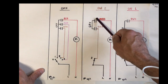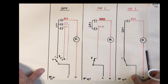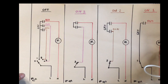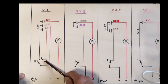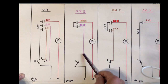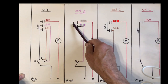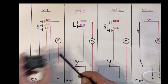That's why this capacitor is the key. If all three speeds are not performing and the switch checks out okay, most likely this capacitor is the problem — because it's the capacitor attached to all three speeds, so it comes into play for all three. Last but not least, speed number 3: the switch is flipped to the third position, which is the purple wire. Follow the path from it — it goes through one of the caps, through the gray wire. That gray wire connection is actually internal to our capacitor bank.